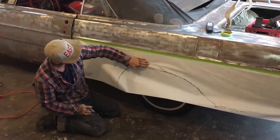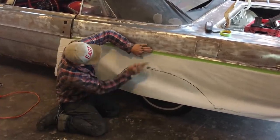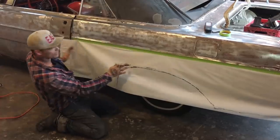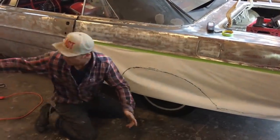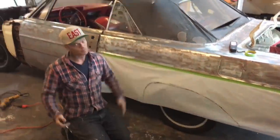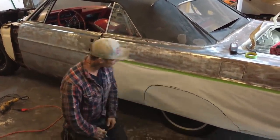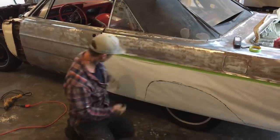And what will happen is I'll take this piece of paper, I'll transfer it to a piece of metal, like always. I'll make my piece of metal. I'm going to cut this in half because I haven't got anything that's 8 feet. I'm only 4 feet and it's too hard to handle. If I had bigger equipment, more people, let's face it, we could just take an 8 foot sheet, put it through the roller, trace the wheel shape out.